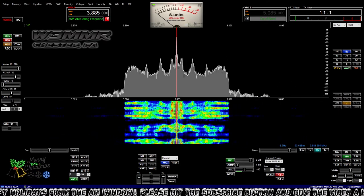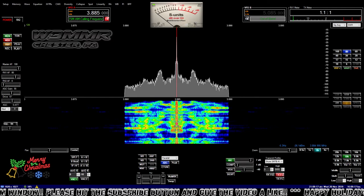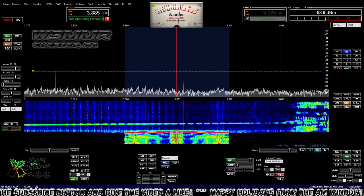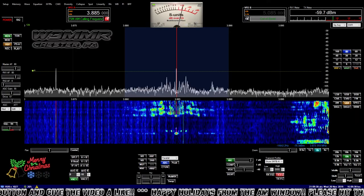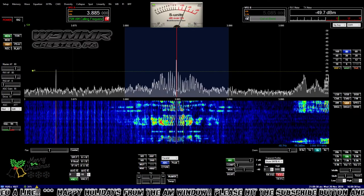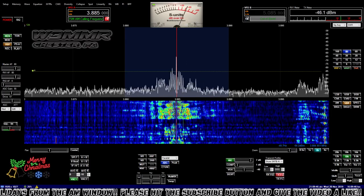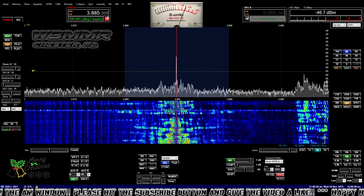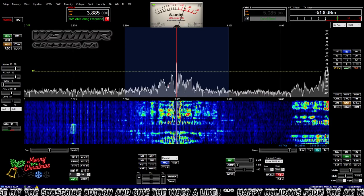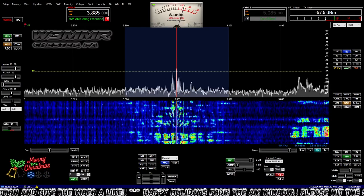I receive much better with this thing hooked up as a short dipole on 160. I'm trying to figure out maybe a receiving antenna idea for my small city lot. It's amazing what it's doing. I had to write it all up so somebody doesn't have to take the guesswork out of it. You'll be surprised how little information I found on horizontally polarized driven arrays with two elements — yes, a lot of it converts over to vertical designs, but when it comes to little details, how do you deal with an 84-degree line and get it to the ground? Of course, you run half waves to transpose the input impedance to the feed point.